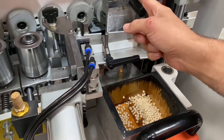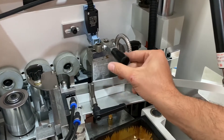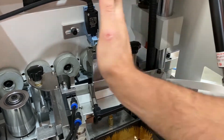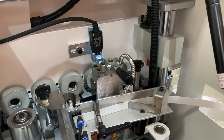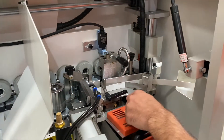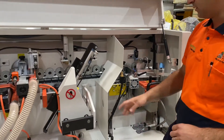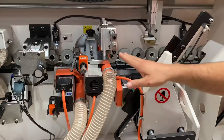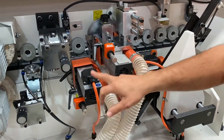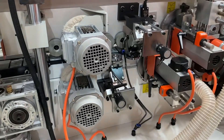To adjust how much glue flows on the machine, loosen off this nut, adjust the bolt, and that will turn the lever left or right — putting on more glue one way, less glue the other. We've got our end saws here — front and back end saw, top trimming, bottom trimming, top radius scraper, bottom radius scraper, and our buffing unit here.